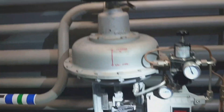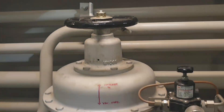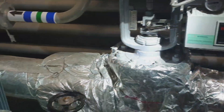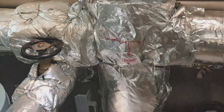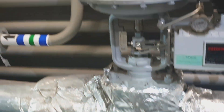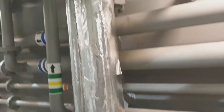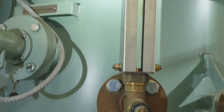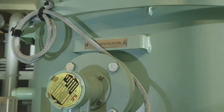Then we have to start the condensate pump and check the pressure of suction and discharge. Then check the three-way valve positioner of the condensate pump, which directs flow back to the condenser and then to the hot well or the cascade tank. This is the gauge glass of the vacuum condenser.